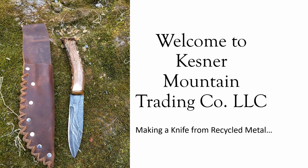Not like this one. This was one of the first semi-successful pieces of Damascus that I made myself with my own little power hammer. It's got a pretty nasty inclusion there that after I etched it in ferric chloride showed up as a rusty crack, and so I gave this away as a gift to someone to use as a sort of a memento, not as a knife that you'd be using on any kind of regular basis. That significant fracture, it's just not going to hold up. So not everything turns out perfectly. Not everything turns out as we plan, but that doesn't mean it's not important to plan.